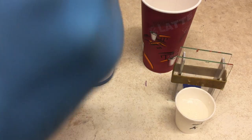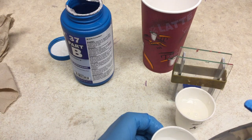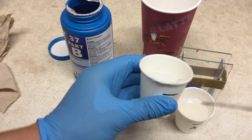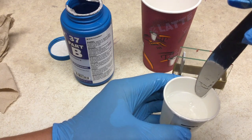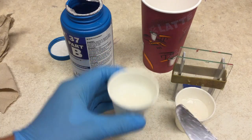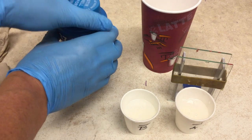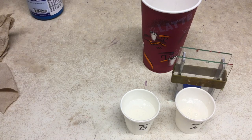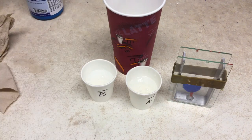We're going to check part B — I've got my cup and I'm doing my knife test. We're close to where we want to be with our volume. So once again, measure on that lip, touch down to the blade, and put that blade to the edge of the cup. We know that part B and part A have the correct volume — they look the same from a sight check and they match the dip test. You could weigh the cups beforehand and do a final check, but we're going to call that satisfactory. Now we're ready to take parts A and B, introduce them into the same cup, and start mixing.